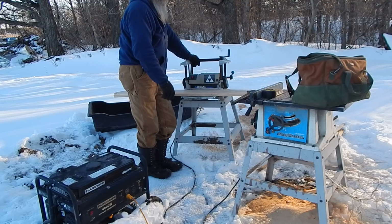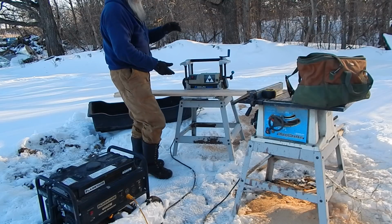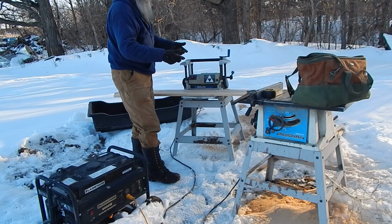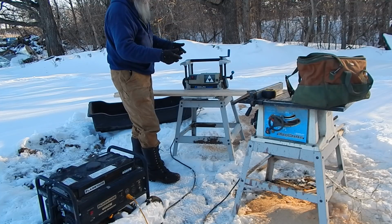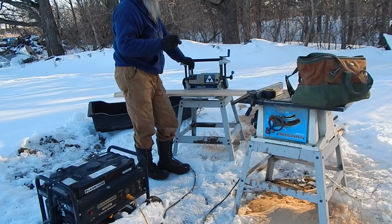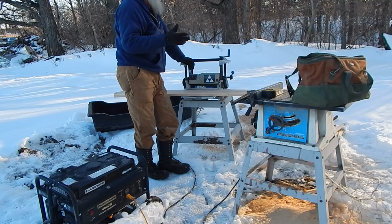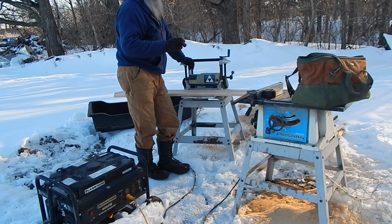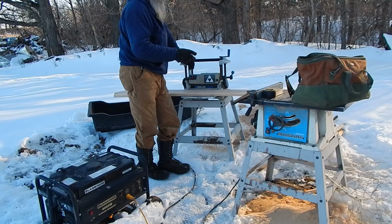And oak would be incredibly heavy, but being made out of ash isn't going to make it any lighter. But it will be made in sections, so it can be assembled, and it'll be held together without any metal fasteners, because it's something I like to do. There are uses for nails and screws and all that stuff, but to me, that usually shows a kind of lack of planning. If you really think these things over, there's a way of doing it without using metal fasteners. That's a better way of doing it. The metal fasteners are kind of a shortcut.